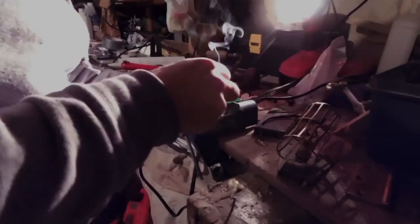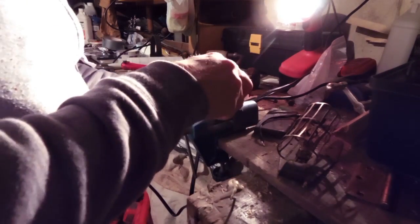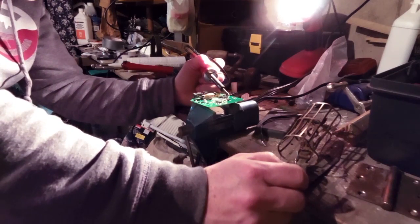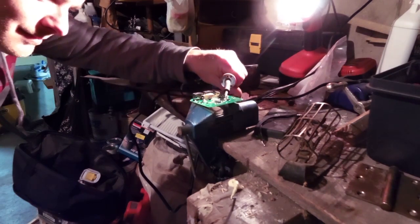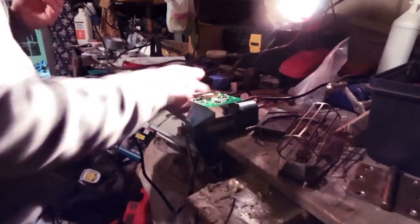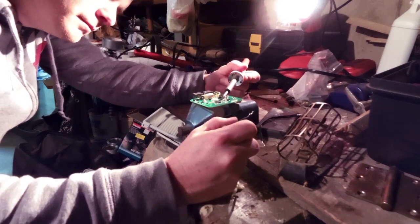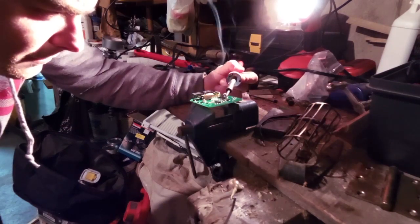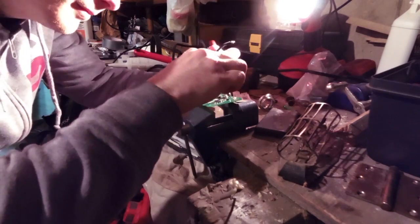I had a lot of trouble with the soldering. I have a double-A battery powered soldering iron, and I also tried my plug-in solder gun - it was absolutely not working. I could not get it to melt the solder on the circuit board. The solder on the circuit board must be high-temperature solder, not your standard kind. I could not melt it no matter what I did - I tried and tried. As you'll see, I came up with another way: I basically ended up using a torch for part of it.